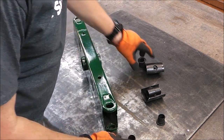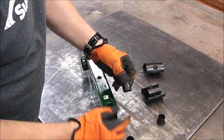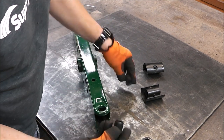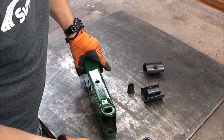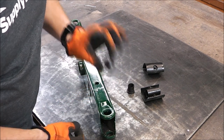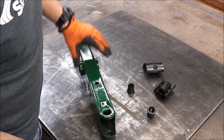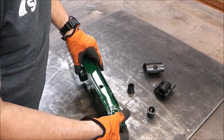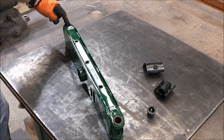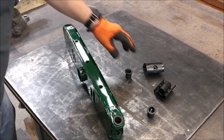So now what I'm going to do - you can see how this bushing's all chewed up - so I ordered two new bushings for it. These get torn up on the bottom; the top sides really don't have any wear whatsoever. So what I'm going to do is put the good ones in the bottom, and then when the new ones come in it's just a matter of popping that cap off - you remember the cap I pried off with a screwdriver - then you just slide this bushing down in and put the cap back on. So for now I'm going to put the good bushings on the bottom. Look how good that fits in there - it actually fits in there way better than this side. This side actually just kind of falls in, so if anything the side we repaired now is actually better than the other side. All right, let's go get it back together.